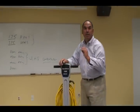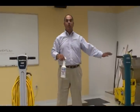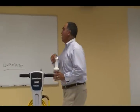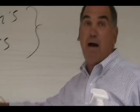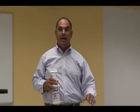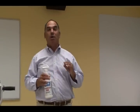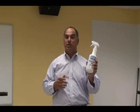Here is the thing you need to understand about spray buffing. When used in a low speed system with 175 or 375 RPM machines and a red and a white pad that we'll show you in a second, you're using the machine to remove dirt from the floor. We don't recommend using the machine to remove dirt off the floor, but it's still done. So that's what spray buff is traditionally used for.